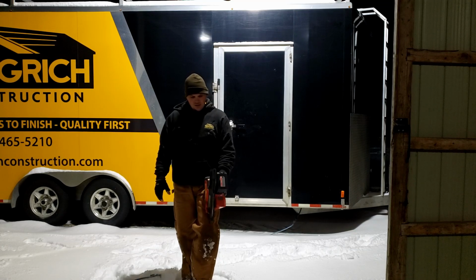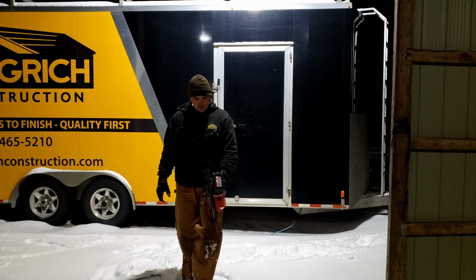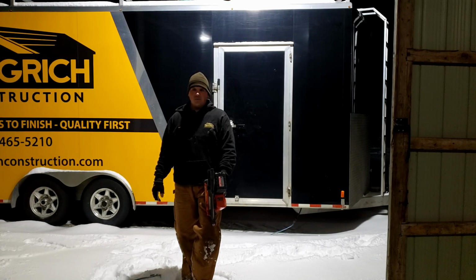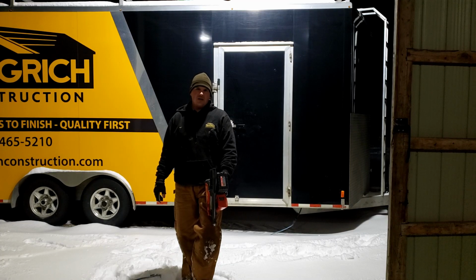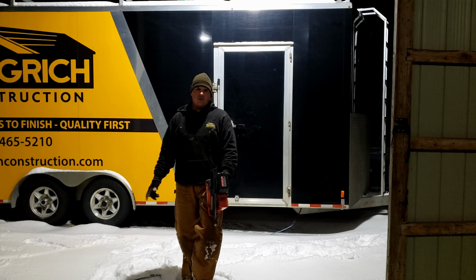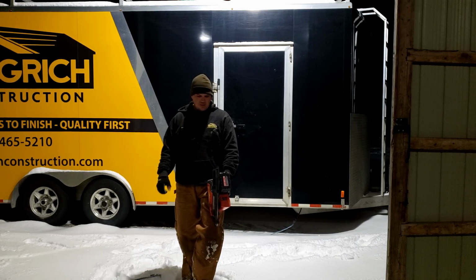Like I said, 8,000 nails is what we're seeing on average per nailer currently. That's disappointing. I would like to see it higher than that, but this is our first shot, and it's a whole lot better than yellow has been for us. I would say to date, the Hitachi Metabo probably will run the most nails through it before it decides to give up. But they are not the production nailer that this is, and we use these significantly harder than we would have ever used a Metabo nailer, just because we use these day in and day out rather than here and there.